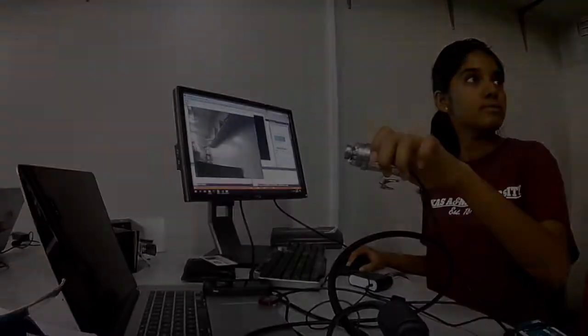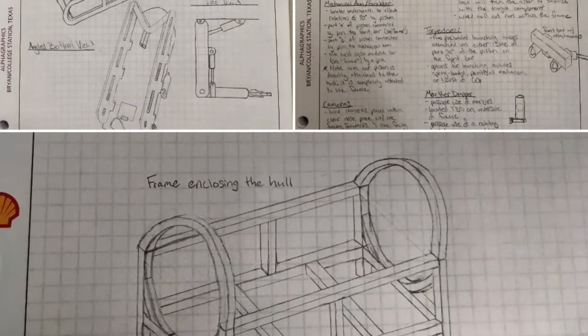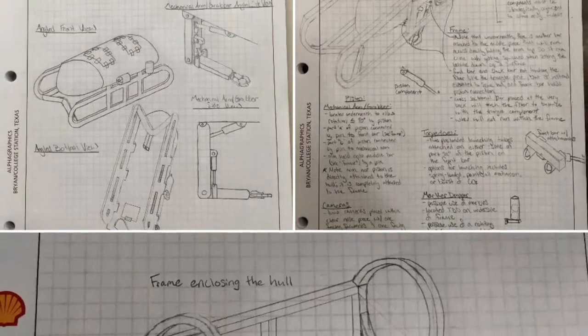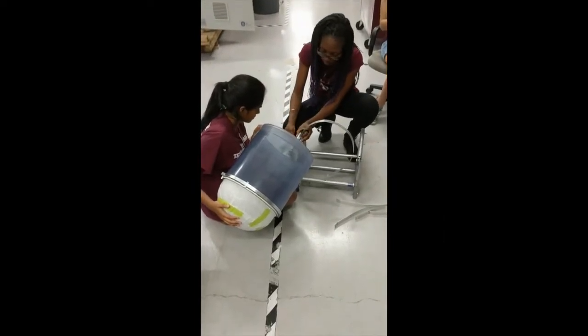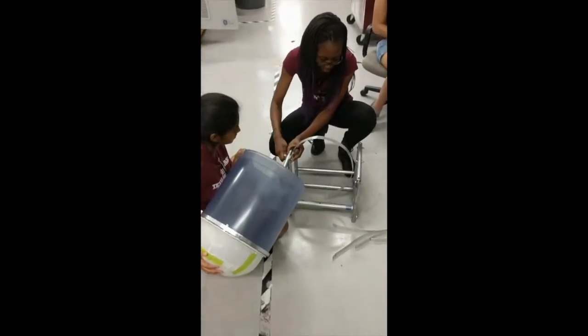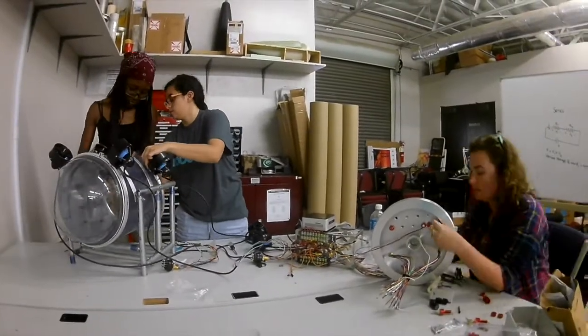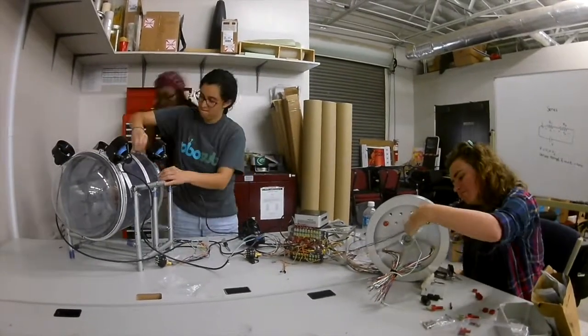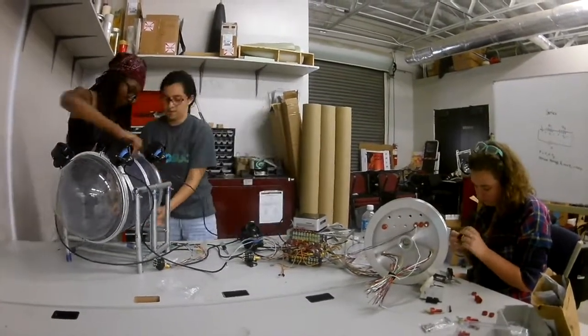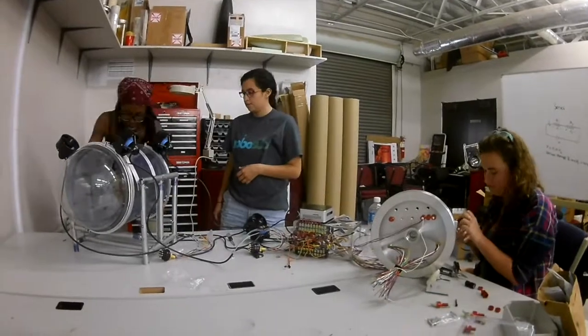The mechanical team has been working on constructing the AUV from scratch. The vehicle frame is made of steel electrical conduit which connects to a 12-inch diameter pipe through two interlocking aluminum rings. In order to seal off the pipe, a 1/8th inch thick Lexan dome is glued to the front of the hub and a 6061 aluminum bore seal end cap encloses the remaining side.